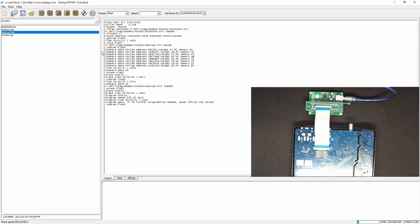This definition is very simple — use the entire block of flash as one segment. If people analyze the content of the flash, they may split the flash into several segments like file system, kernel, kernel one, or kernel backup.